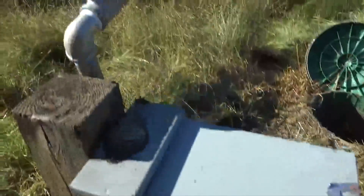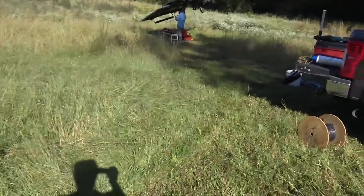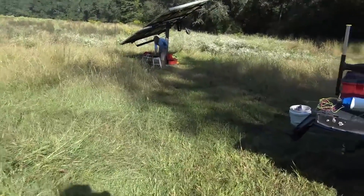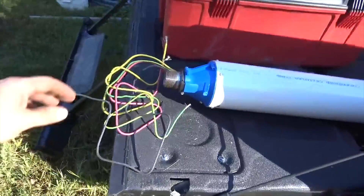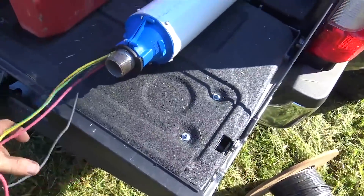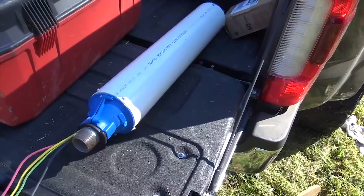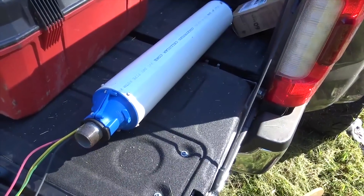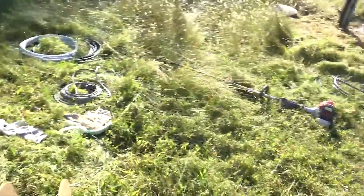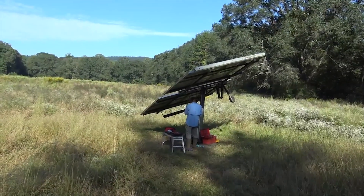We're going with a Franklin photon system. We have flow sensors and we're mounting the controller out here on this pole. There were some problems with existing PV wiring we just need to change. These pumps are three or four wire, three-phase motors — super heavy duty, lots of copper. Franklin's known for really long-life motors. The centrifugal pump can also tolerate some dirty water, which is the plan.